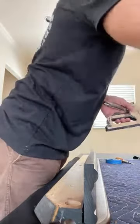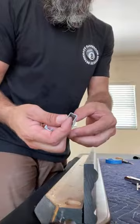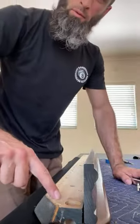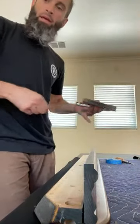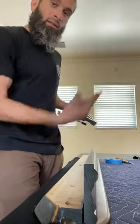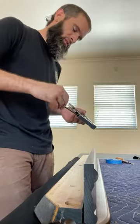And again, we are using quarter inch staples. There are 9/16 staples, and you can see the difference. The reason why we use 9/16 staples is either the wood is too chewed up right here, like on an antique or something, we'll use a bigger staple. But we use those 9/16 to staple the pockets into the liner, the fingers on the pockets, the flaps, to staple them on so it secures the netting. That's the only reason really why we use those 9/16.